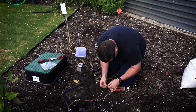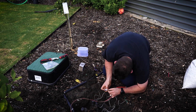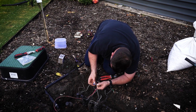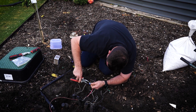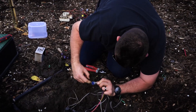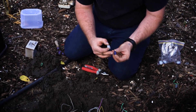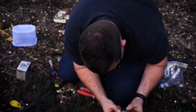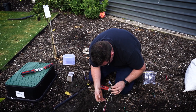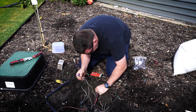I've got five cables that I'm going to try and get into one wire joiner — that's not going to work. So what I'm going to do is join three of them together in one wire joiner by pushing that down. That has pulled all the cables in and pushed silicone into the hole, so there's no water getting in there. There's a metal piece inside that blue connector — it slides down past the cable, cuts past the plastic, and makes a metal-to-metal connection. By joining those three together, I still have to get the common from that valve joint, so I just have to join the black cable to those three.